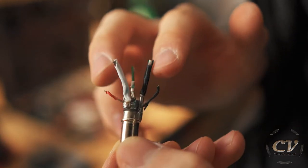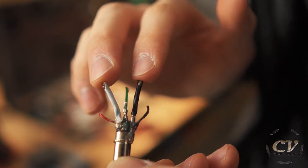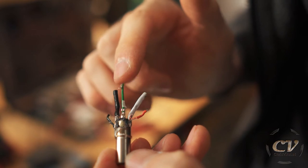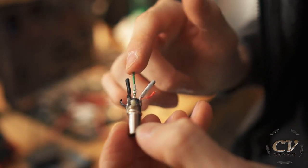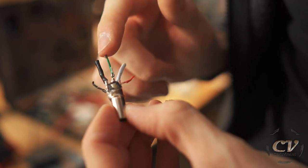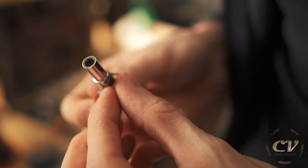These two wires power the little LED ring. And the two main wires are for the power transfer. The green one is for data transfer — or possibly measuring something to communicate with the power brick. Don't quote me on that, but this is an important pin.